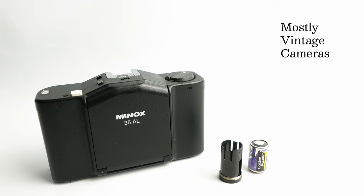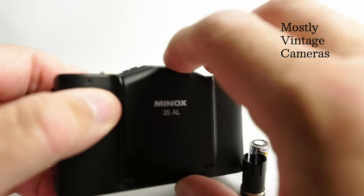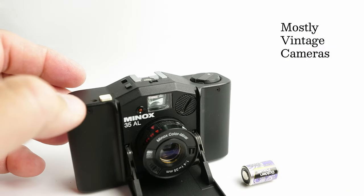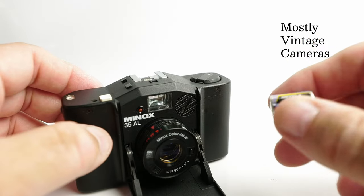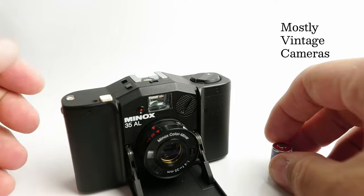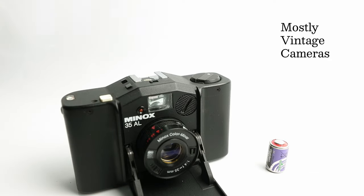Now, some people will say if you use a 6 volt battery, the camera is prone to overexpose by as much as 2 stops. I'm not sure I entirely subscribe to that school of thought. However, that is the experience that some people have reported, and I have to respect the fact that is their experience. For me, because the original Minox adapter took 2 3-volt cells, I'm inclined to feel confident or comfortable using a 6-volt cell in the camera itself. And so whilst I can't tell you what's going to work for your camera, I can tell you I used a PX27A silver oxide 6-volt cell, and I had no problems with operation or exposure, and it worked just fine. Possibly it won't last as long as an original mercury cell would, but I'm not going to be using it that often for it to be a concern to me.